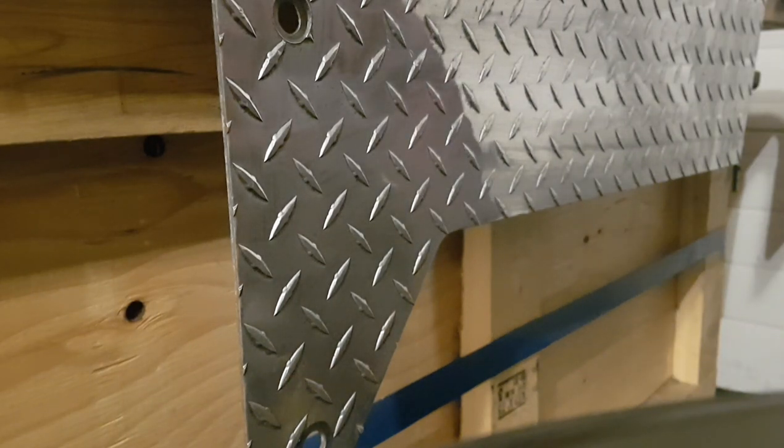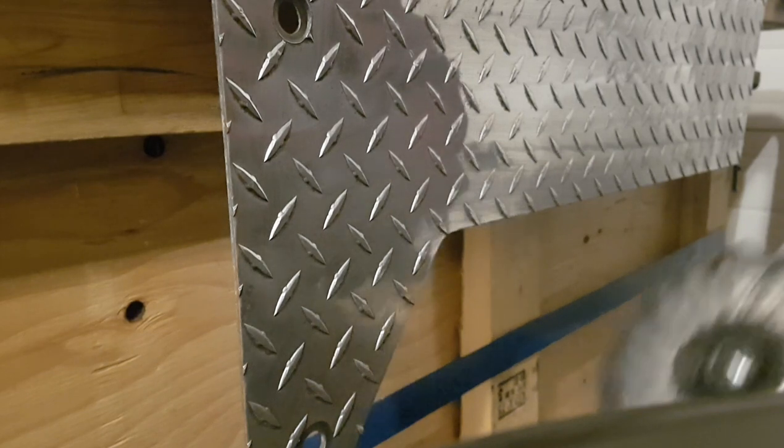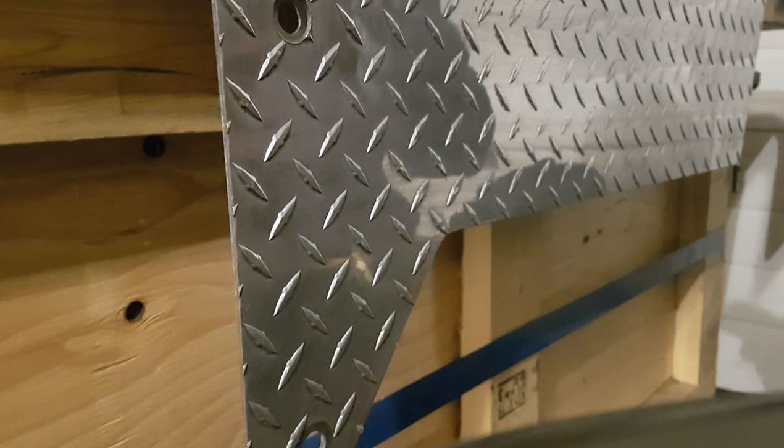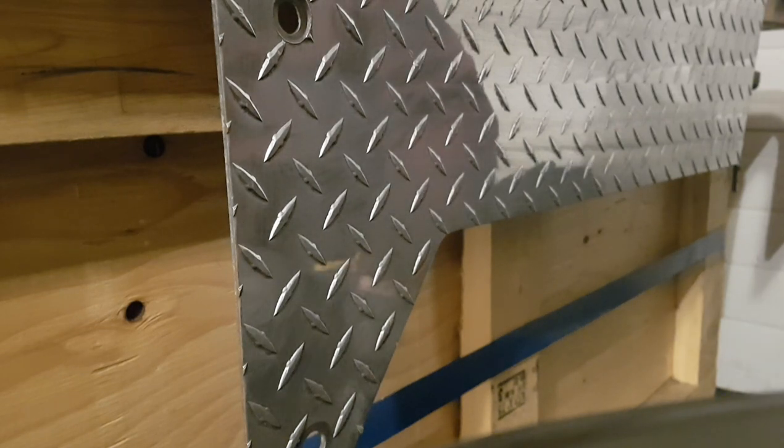Some guys use white. It's up to the individual, really. I find the blue gives a better shine. That's just my opinion, but I know other polishers are dead set on the white, which does a good job as well. So this polish is like your finishing sanding, I guess, a 1000 grit or whatever. It does no cutting at all. If you've missed anything with cutting at this point, you need to go back, because this polish won't cut. It strictly colors.